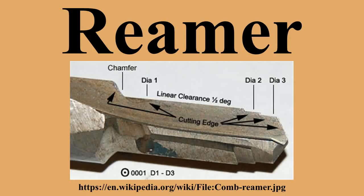Aluminum and brass are typical workpieces with good to excellent machinability ratings. Cast iron, mild steel and plastic have good ratings. Stainless steel has a poor rating because of its toughness and it tends to work harden as it is machined. During the process of reaming, friction causes the part and the tool to heat up. Proper lubrication cools the tool, which increases the life of the tool. Another benefit of lubrication includes higher cutting speeds, which decreases production times. Lubrication also removes chips and contributes to a better workpiece finish. Mineral oils, synthetic oils, and water soluble oils are used for lubrication and applied by flooding or spraying. In the case of some materials, only cold air is needed to cool the workpiece, applied by air jet or vortex tube.